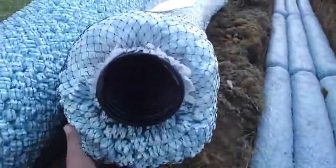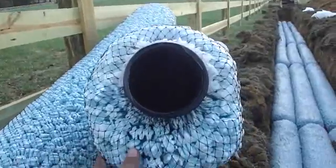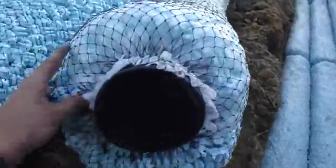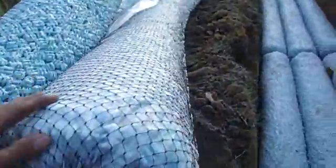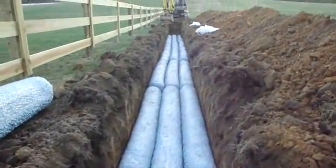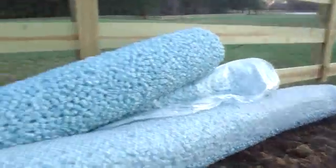It's kind of how the 4-inch pipe goes right through the center of it. It's got a little more peanuts on the bottom where all the water goes through. It's got a slotted pipe and a piece of fabric to keep the dirt out of them. Then, whatever works.